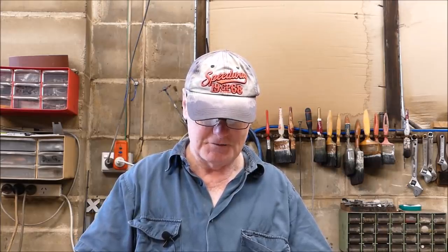I'll read the comment I got — bear with me, I'll put my specs on, the old eyesight's not what it used to be. The comment's from Joe C&C, and it's in regard to a video I put up called 'I Get Fired Up Over My Sherline Metal Lathe.' His comment is: 'Love the T-slot cross-slide that you have on that Aussie version. The US version has two long slots. I wish they had better and bigger anti-backlash nuts.' I replied back: 'I agree. Many new lathes, not just Sherline, have longitudinal T-slots, and I think it's a bad move. It must weaken the cross-slide dovetails, and that is where all the compound leverage is focused. The British way of doing it — crossways — is much better, in my honest opinion.'